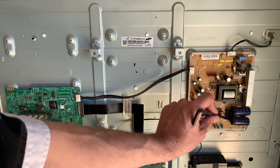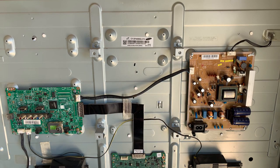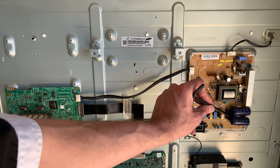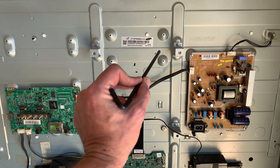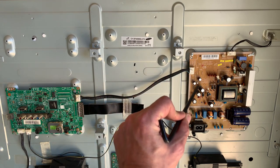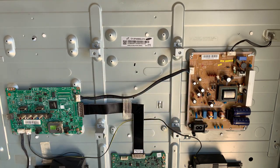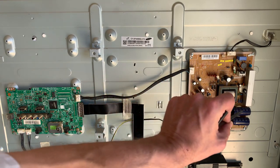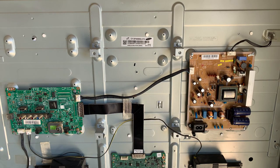It gets rectified, the AC gets converted to DC, so 230 volts here in South Africa, rectified. You will now have 325 peak on that side, so the AC wave now becomes like that. We're looking at the peak value, that'll be 325 volts on that side. Again, it will be a thing with a trough, and that is why they've got these bulk smoothing capacitors in.